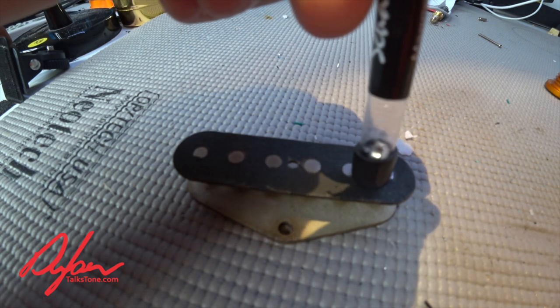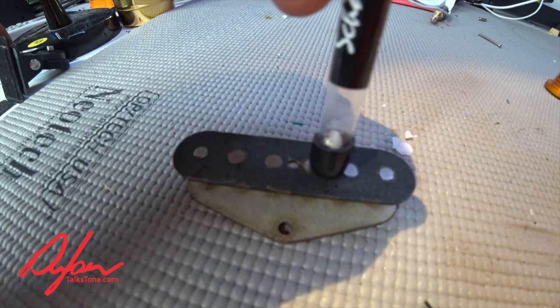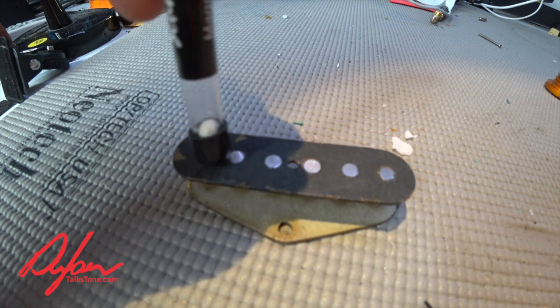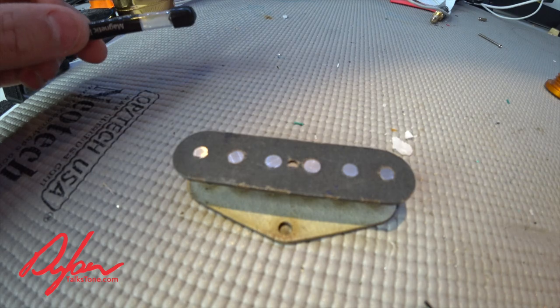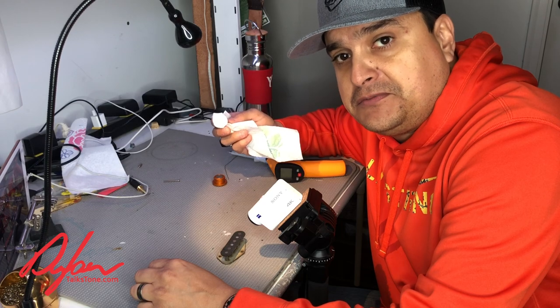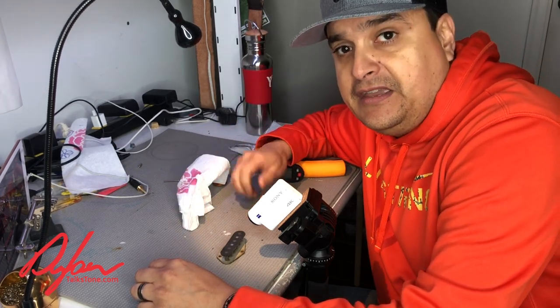The polarity of that pickup has changed. See how the pickup — the little magnet is sitting on the side for this pole and this one, then it moves a little bit for that one, and then goes all the way over the other way for this one. What you have done is ruined the polarity of your magnet in just three or four small passes of a Neo magnet wrapped in a paper towel.